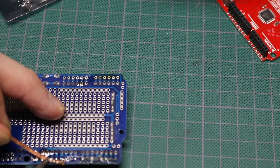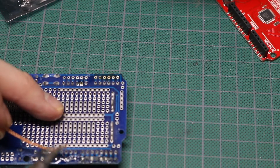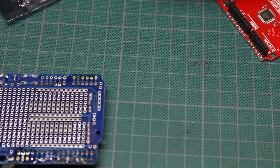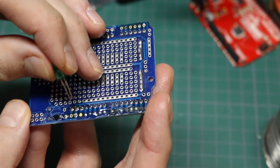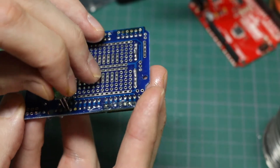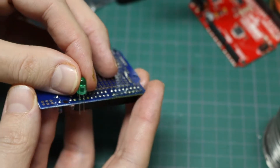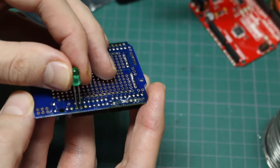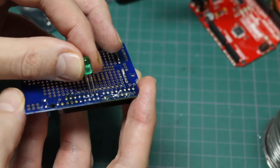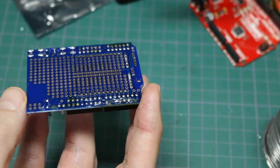There's probably a lot of solder in here because of adding all that extra to get the pins out. After three passes, the hole is finally clear, just like the last pad - so those first two are now clear. I'll take an LED and put it through those first two holes - no problem. I'm going to keep on going and clean up all of these header holes and try to get the new headers in.